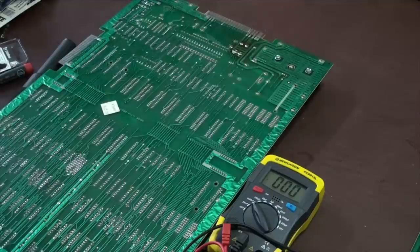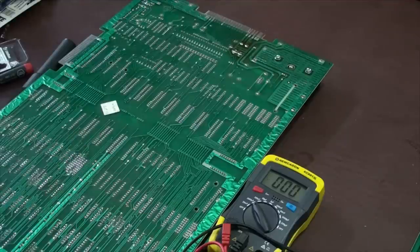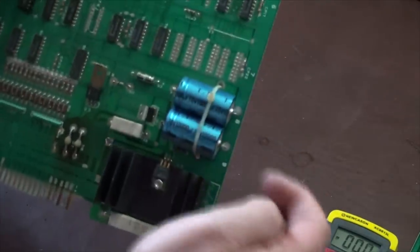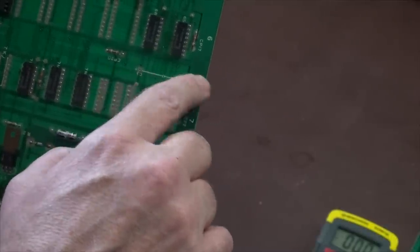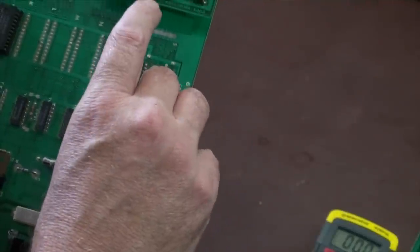And also when you're taking things apart like this, it's good to take pictures or it's good to film. That way, if you have a whole bunch of parts out and you say, oh my God, where did they go? You have a record of where everything went. But this guy gets replaced. I've already ordered all the parts for these. You'll see right here, this is where the capacitor went. It's got the positive. It also shows the symbol of a capacitor. It tells you it's C3. As long as you have the schematics, you'll know exactly which one you're supposed to get. But this one goes there.